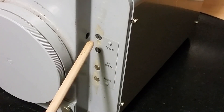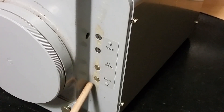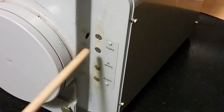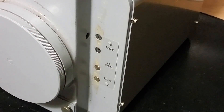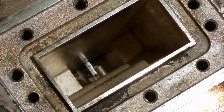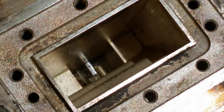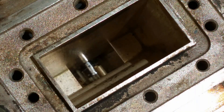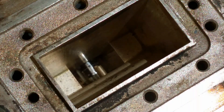Here we got the side with these knobs that control the waveguide filter. We got some screws in the waveguide filter that these are attached to, and you can change how deep they go into the waveguide. Here you can see inside of the waveguide - you can see the two screws here, and on the bottom you can see the vacuum tube.